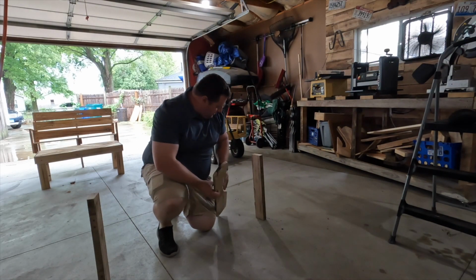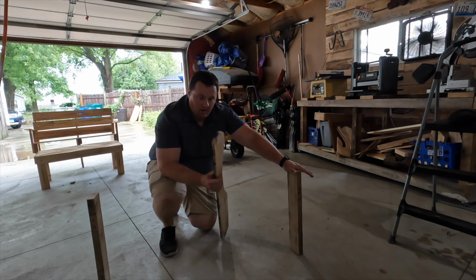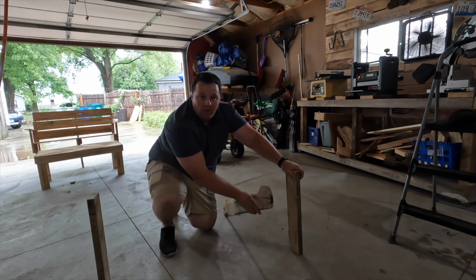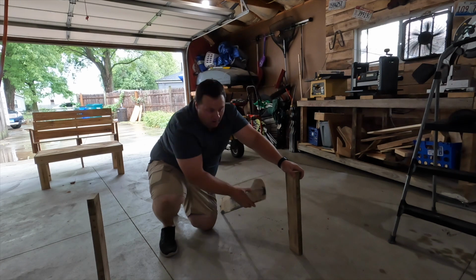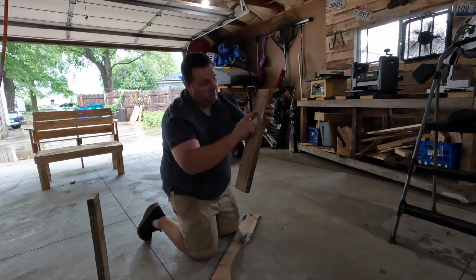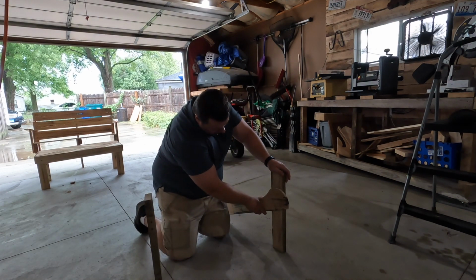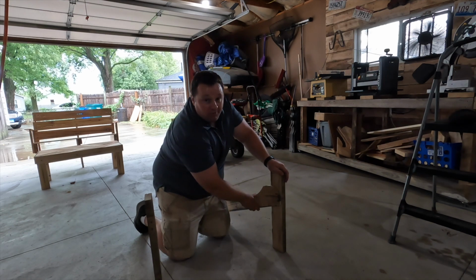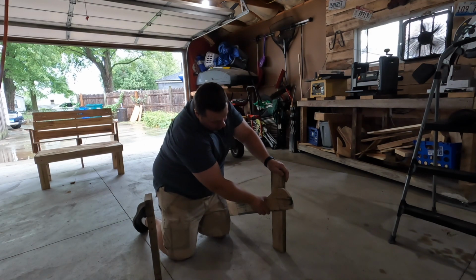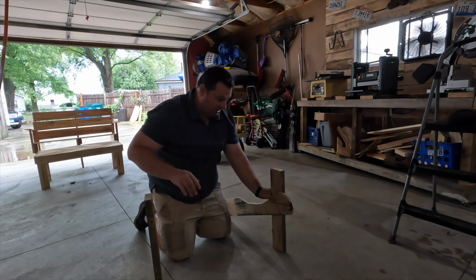Okay, so a few things. I've got my 20.5 inch tall front leg posts. I've got my rear leg posts. Everything's ready. How am I going to keep these uniform? How am I going to know that I've put them at the same spot? I put a notch 16 inches on each of my front leg posts. So that's the height I want to be at. Now, 16 inches high, got the mark there, so it's going there. Where am I going to put all of these so that it's sticking out at the right angle I want it to? Well, I determined I wanted it right about there. And this particular one has a little notch that made it a nice, easy spot to pick.